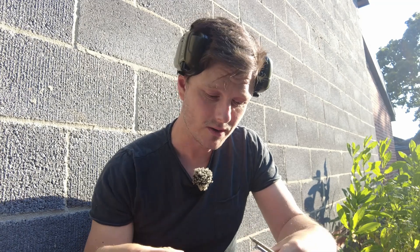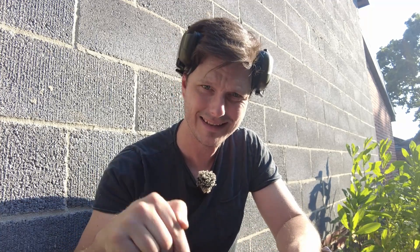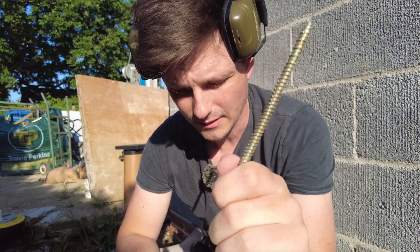What I want to know is: if I take these fittings out and loosen them up, can I use a chemical resin to inject into there and will it re-drill afterwards? Especially because I would prefer to use the concrete fixings, and two of those holes are too big for this.